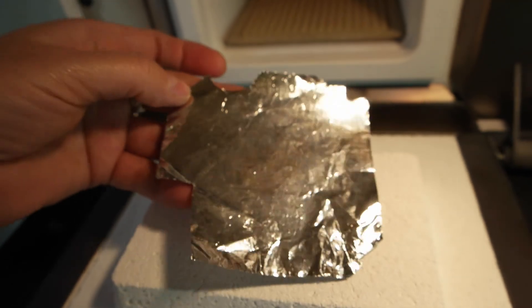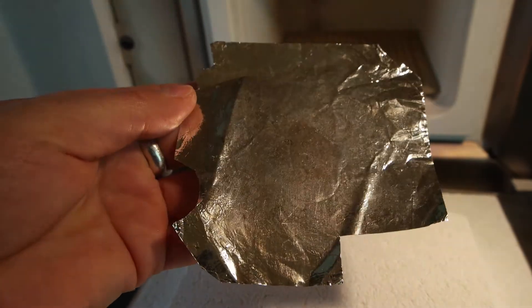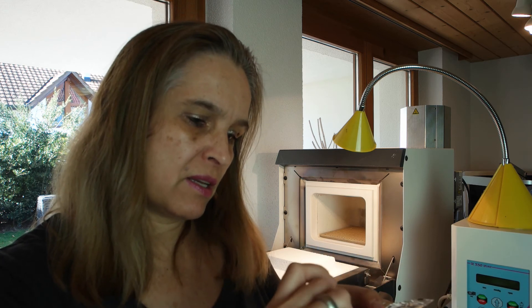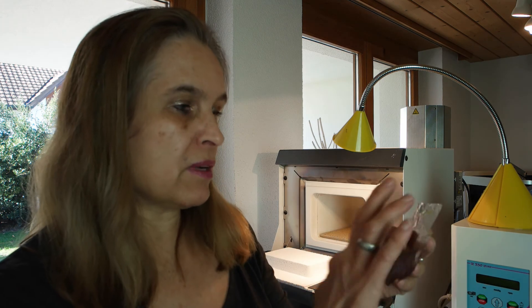I guess if I had left it there for one hour it would have totally disappeared. What you still see and feel are these tiny little grains, but the rest looks really great. This filament seems to perform just like the other one — I also turned it off at 1000 degrees and the flocks disappeared. It was still a little bit grainy on the surface, but I think that would have vanished with a longer hold time. I'll clean this totally, and the next one will be the I-Beam natural. I guess the raw materials that different companies use are all more or less the same. Bye-bye!